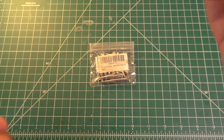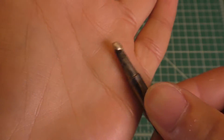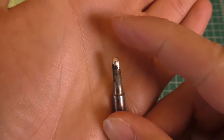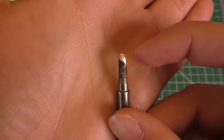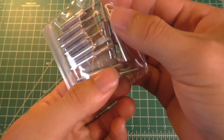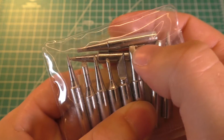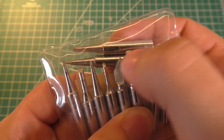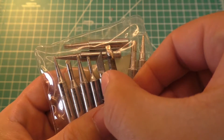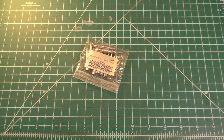One other note on quality of these knockoffs is that some of them don't seem to be machined quite right. It looks like the top of this tip isn't completely straight, and it's not. That's the 3.2 millimeter tip — you can see how it's supposed to look on this bag of tips, it looks pretty nice, but this one came from the factory being messed up. The manufacturing quality on these tips isn't the greatest.